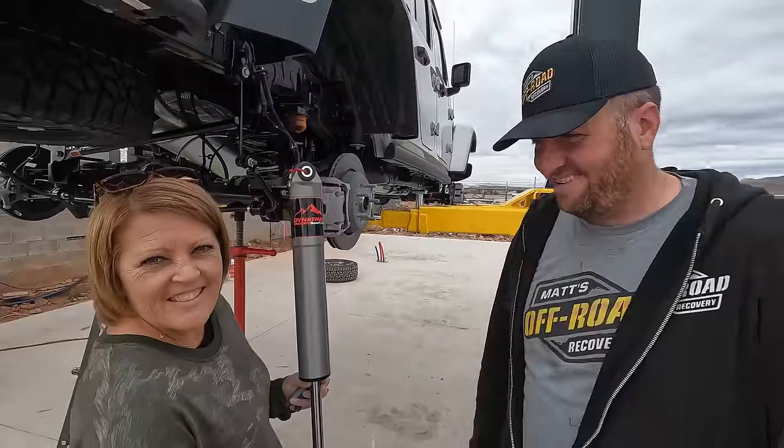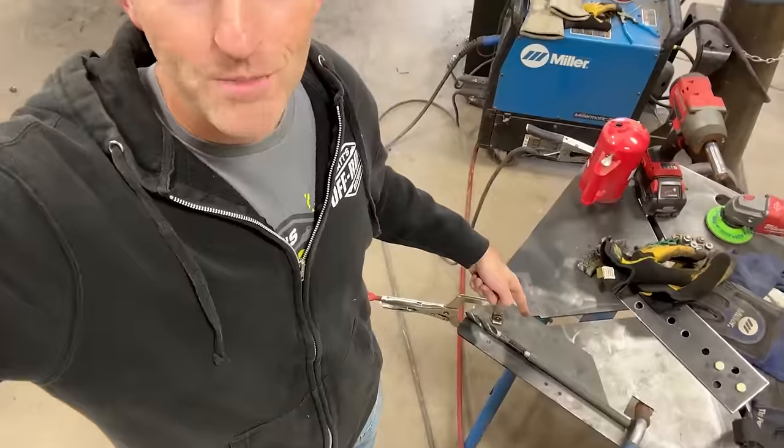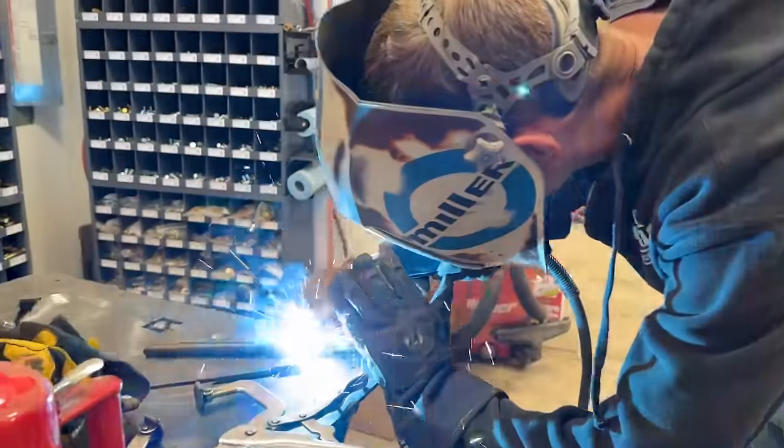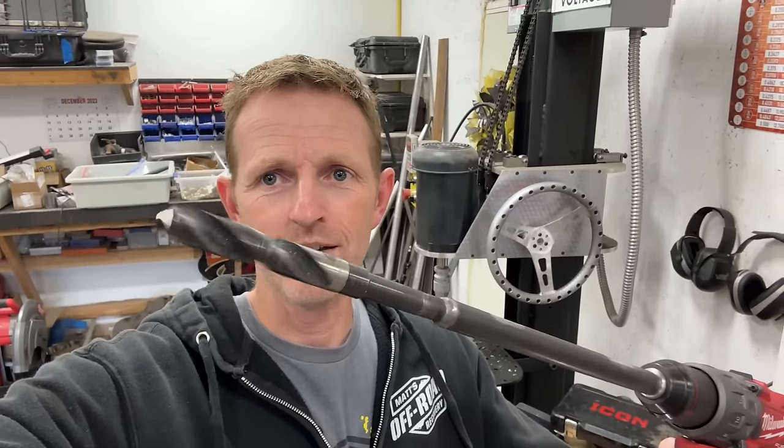Seven hours — they ain't got nothing on us. I just got a call from Holly. She's looking for a 5/8ths drill bit that's 14 inches long and we don't have anything like that, but I do have a 5/8ths inch drill bit and plenty of bar stock. So we're going to weld together a drill bit that's long enough so she can drill out these bushings. She jumped her jeep and broke the 9/16ths bushings. My drill bit is complete. Holly showed up — there you go, hope that works amazing for you. You're beefing up the race jeep — 5/8ths instead of 9/16ths, it's going to be tough.